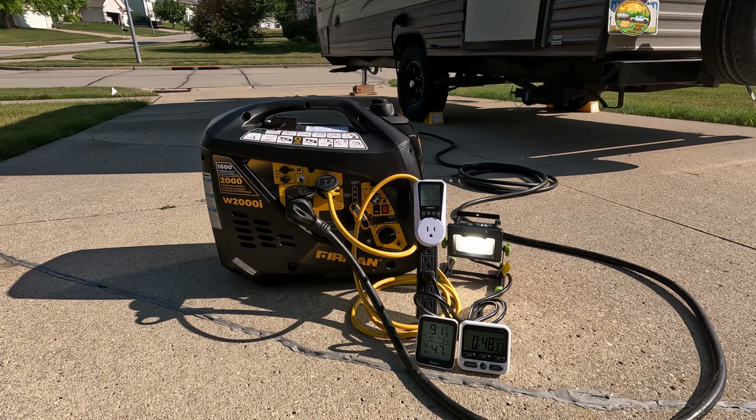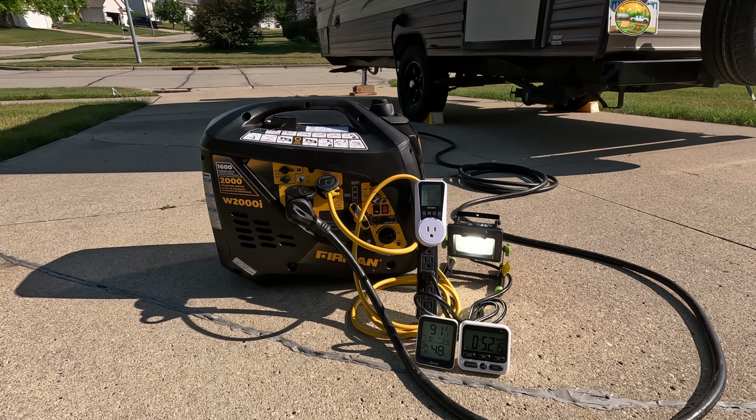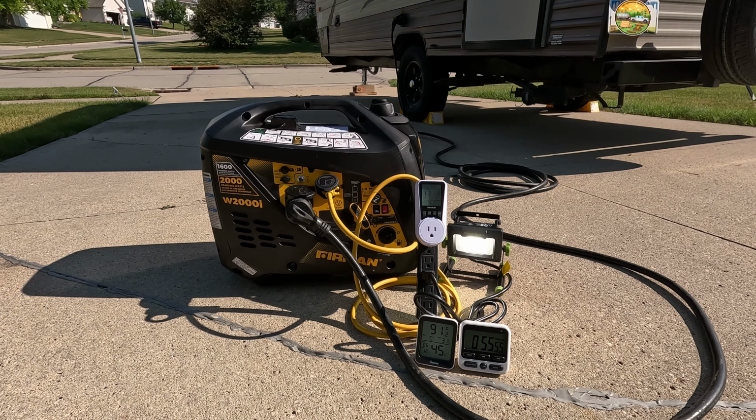At this point in this video, I have about 60 hours on it, and I've done 3 oil changes in that time just to get all of the metal flakes or anything else like that tamed down and out of the system so it's not continuing to run through there. Now, in that time, I have run a magnetic dipstick, and by that third oil change, there was hardly anything even on there. But as you'll see throughout this video, it does burn a small amount of oil every now and then, and you really have to be looking for it. So it has tamed down.